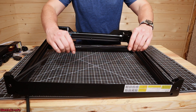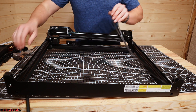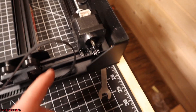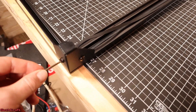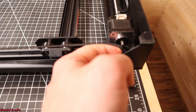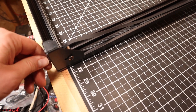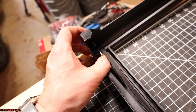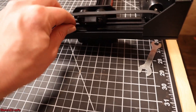Now with the laser still upside down, I'm going to put the belts on. We've got one on this side and one on this side as well. The belt goes from this wheel right here along the track and needs to be attached right up here. Now if you first grab this and realize that there's no way you can get that around, you can take your Allen key and loosen up this side right here, and that will give you the freedom to get this pulley around that wheel. I noticed that the screw just came out, so I need to get that reattached, and I also need to make sure that the lower side of this belt goes into the groove right here.